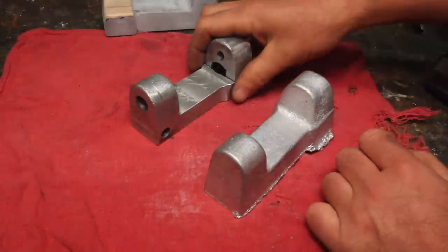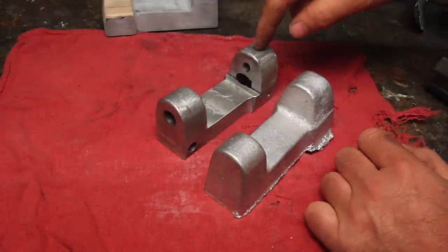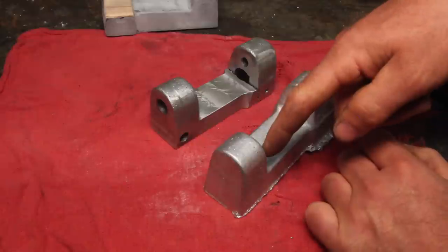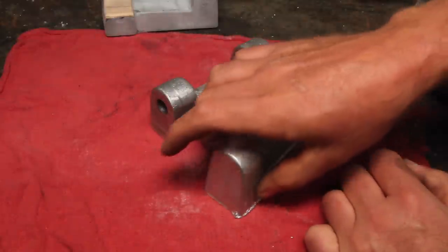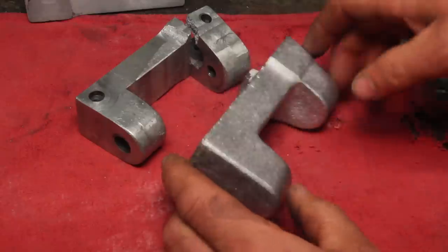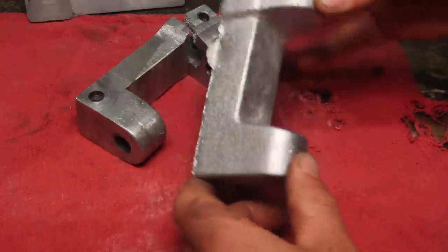So going back and looking at this, I did a lot more machining on this one than I really need to. Really what this needs is these faces cleaned up, a hole through here, these faces cleaned up, and these two holes, and a counter bore on there. But in order to do things from three different orientations, you need to be able to reference it.